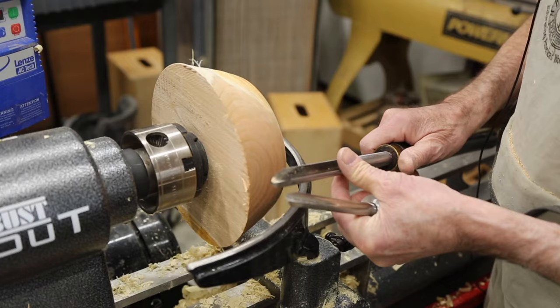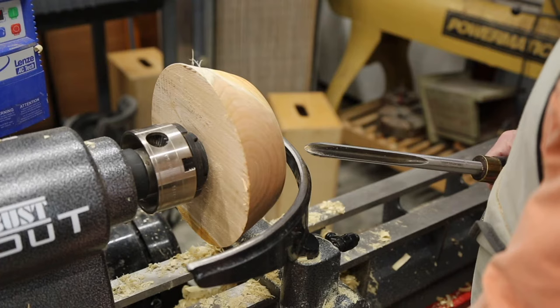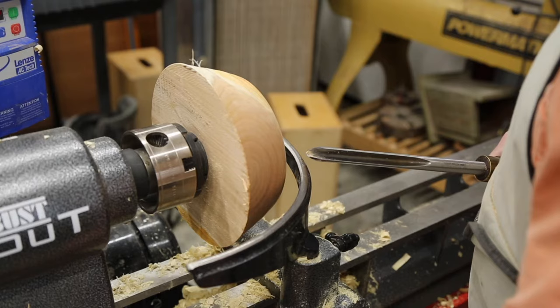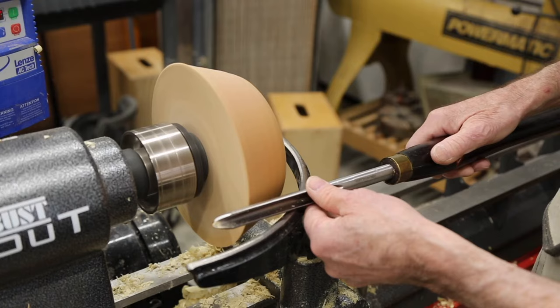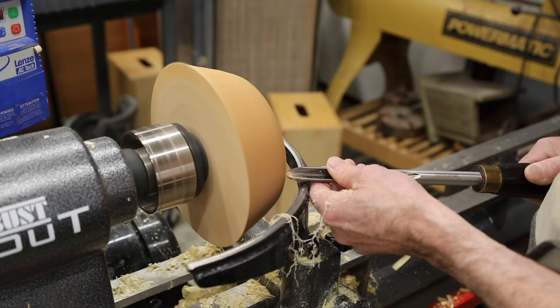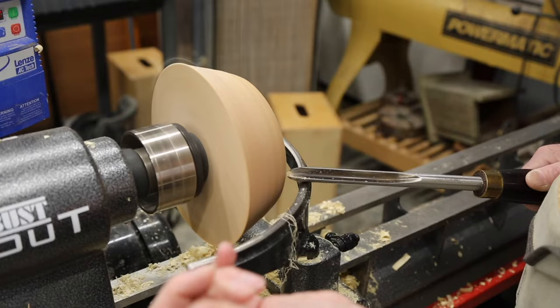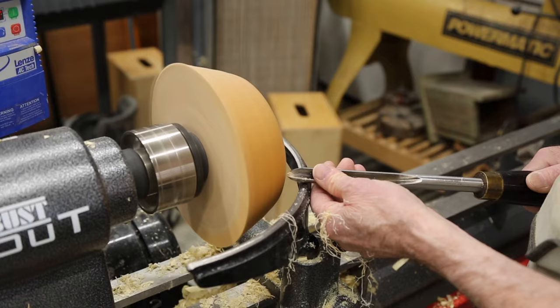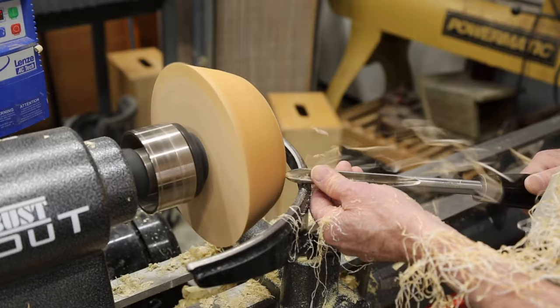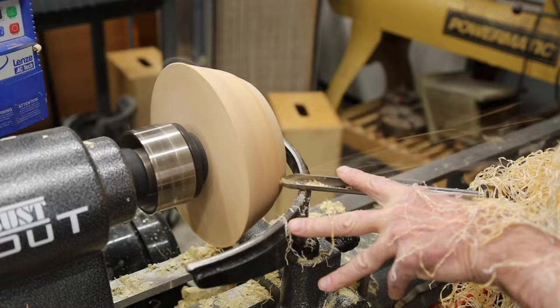We explained the grinds in last month's session, so this month we're going to look at how we make this cut the way we want to. To turn the outside of a bowl, we turn the lathe on and present the gouge level on the rest — the whole gouge parallel to the floor — and touch down to get it cutting. We've got the flute pointing to about 9:30 to the left, or 2:30 if to the right, and we get it going and then turn it until it comes sweet. Simply pushing on the handle along the shaft makes it scoot along on the nose bevel and go in the direction we want.